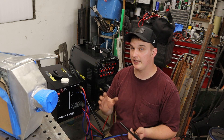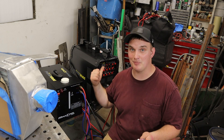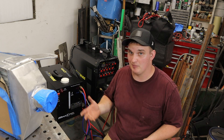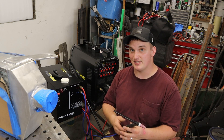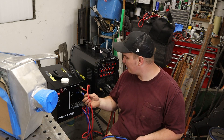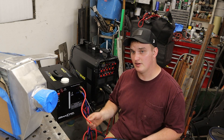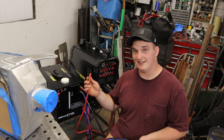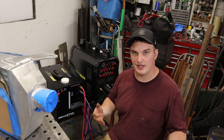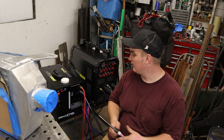Running the air-cooled torch on there, I could only get away with about 6 to 8 inches of weld at a time — not because the machine can't handle it, the machine will keep trucking — but I've gone through a couple of No. 17 torches because I've burnt them up being air-cooled. So I'm super excited to use this and not burn up torches. The con is that the alarm system is extremely sensitive on this thing. I guess that's a good thing so you're not burning stuff up, but it feels overly sensitive. It's not any louder than other water coolers I've had — it's just the nature of having a water cooler, one more thing making noise in the shop.